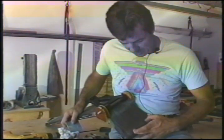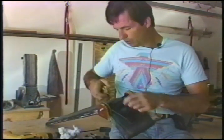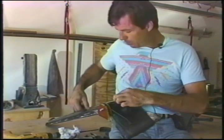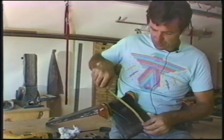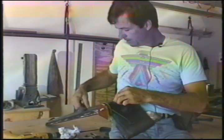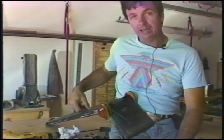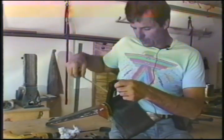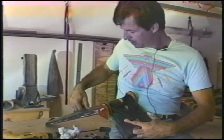So we're going to sand all the way to here. We're going to sand to 1 foot, 10 inches below this point. So it's 7 inches or so from the bolt center this direction, 10 inches below to this point here. We're going to cut 8 plies of carbon fiber that run from this point to 10 inches below.